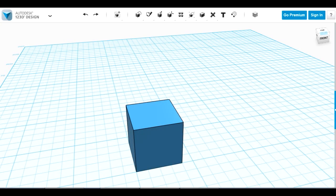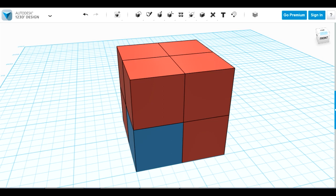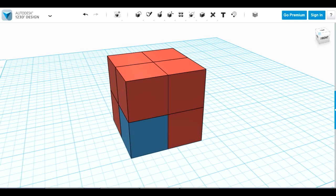A couple of extra things about building scale droids. Some builders have successfully built an axle drive system at half scale or less, and it seems logical that if you can build a half scale one you only need double the motor power for full scale - but that's not actually the case. If I take this block and make it twice as big in all three dimensions, it's a cubed function. What you actually end up with is something that's eight times the volume and therefore eight times the mass - you need eight times the torque and eight times the power. Balls will work out slightly differently but it's definitely more than double, so if you're doing a half-scale test and doubling everything, the motor torque requirement is much more than double.